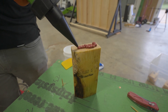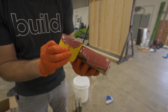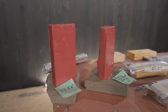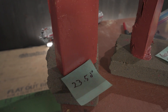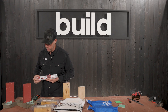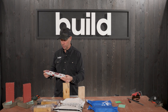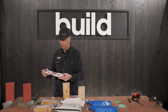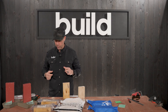This product by Prosoco, a long-time Build Show sponsor — I've used a lot of this. This has a perm rating, so even though I've coated all six sides of this — actually Nathan did it for me — we believe that this will dry out over time. Before we coated it, you can see the moisture content was 23 to 25%, so almost saturated. In Fast Flash, if you put it on at the correct millage — I want to say the correct millage is like 15 mils or 12 mils — it should have a perm rating of 14, meaning that you can dry through the product.